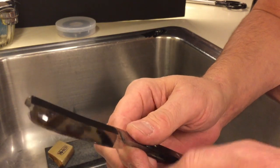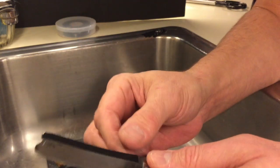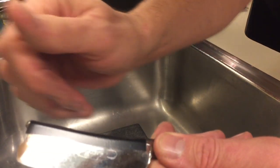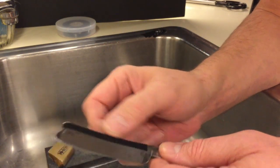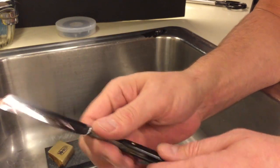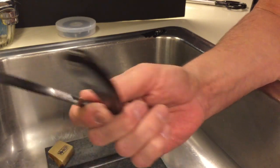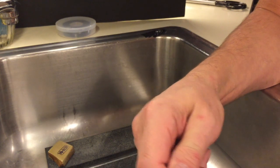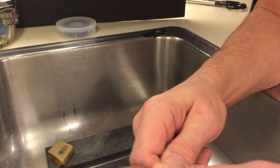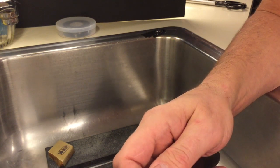It makes honing not fun. All right, so leaving the base down and putting a layer over it, you'll find that a lot of times with those big wedges, especially if it's a really big blade, two pieces of tape is where you want to be anyway. But you got to use the bevel angle calculator to know. I showed you that in the last video. Always rely on that before you go making decisions like that. Once you take steel off, it doesn't go back on. So you could get yourself into trouble or just cause yourself a lot of extra work.